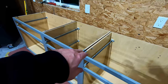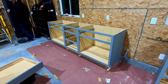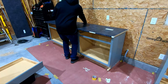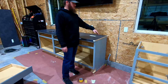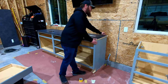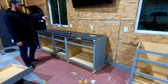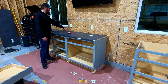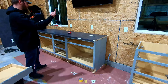I got those brackets on — I only did two brackets in the middle cabinet, didn't think the extras were necessary. Now I'm putting the countertop on. I was going to match the overhang on both sides, but since I don't know what I'm doing with the miter station yet, I'm just lining this up with the edge of the face frame. The back is flush, and there's about an inch overhang on one side, which will be fine.